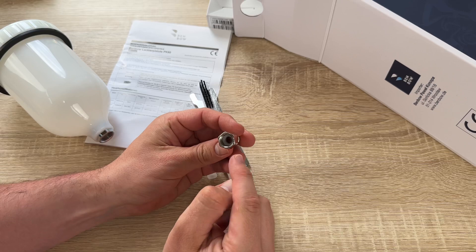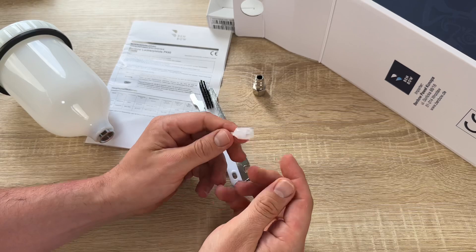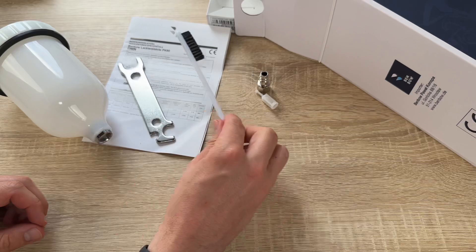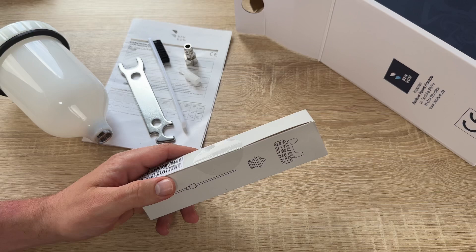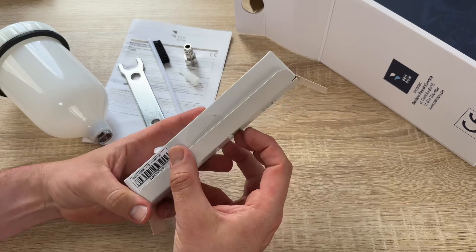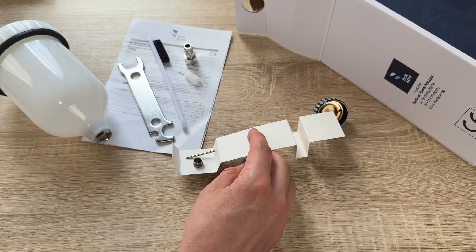The process occurs when paint is applied to an object through an air-pressured spray gun. The air gun has a nozzle, paint reservoir, and an air compressor — which you have to buy separately. I bought an air compressor with 50 liters of capacity and 10 bar maximum, but I can press it down to 3 or 4 bar, and it works really well with this paint gun.